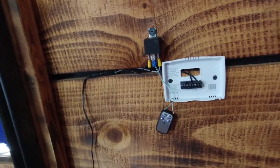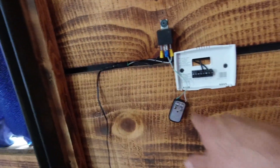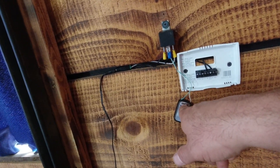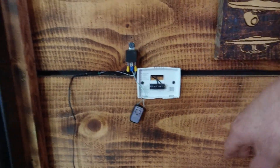I just wanted the relay visible so I could see the LED come on whenever the heater turns on. Anyway, all you have to do is put everything together and your thermostat is ready to go. My heater is running right now and that's what's going to maintain the heat. One thing I noticed — running the diesel heater wide open all night, it did get hot in here, but I wanted to see fuel usage. It used about half of the tank — roughly a two-gallon tank — so about a gallon for 12 hours running wide open.